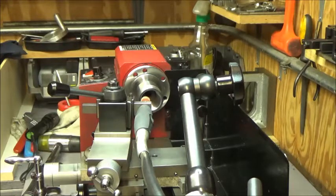I had an anxiety attack this morning, so I came out here and just decided to set up the angle of the bore and so forth, and set my tenth indicator up on the cross slide and get the angle of the compound at 8 degrees. All that went so darn smooth that I just couldn't wait. I know I have the grinding bits coming from McMaster probably tomorrow. I ordered last night, so they'll probably be on a truck today, but I just couldn't wait.